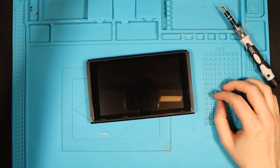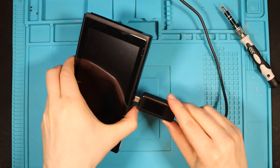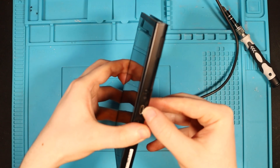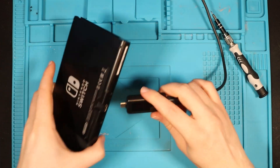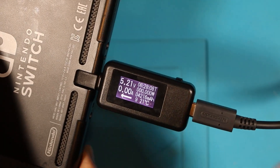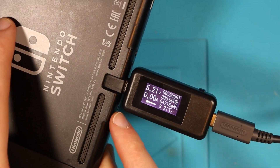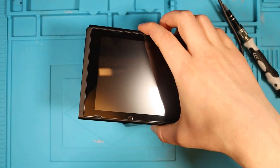I've taken three screws out, but before we go further I'll test it on the amp meter. This USB-C amp meter tells us the current draw of the Switch. It's flashing again — we had this last week. That could be M92 damage rather than the port itself, but the port does have pins out of place. Trying the other side gives us 0.0 amps. Same sort of issue as last week. This coming back at 0.00 tells me there's something wrong other than just the charging port. Could today be an M92 replacement plus charging port? Let's have a look.